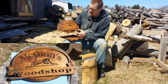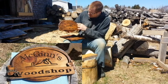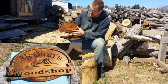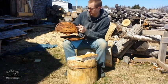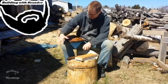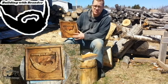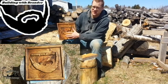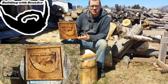So for this piece, there's some 3D carving involved for the scroll and the backdrop, and then there's V-carving and something called Prism Carving — I'm not really sure exactly what that meant. But it did give the result of the V-carve look for the logo that I was looking for, so that worked out well and I'm really pleased with those results. This here is the result of V-carving and then using the flat back option where I can clear out the back, clear out most of the waste, and then come over with the V-bit and do the V-carving, so everything pops out as opposed to going in — it's just an opposite way of doing it.